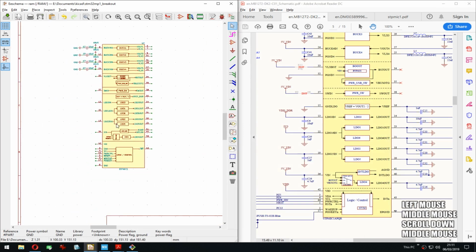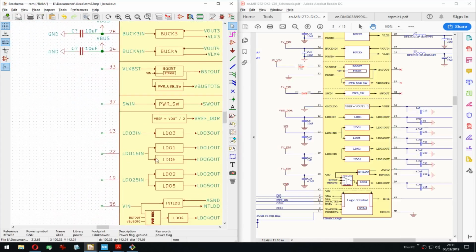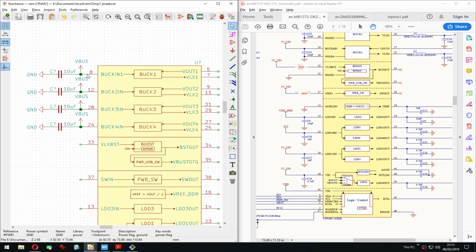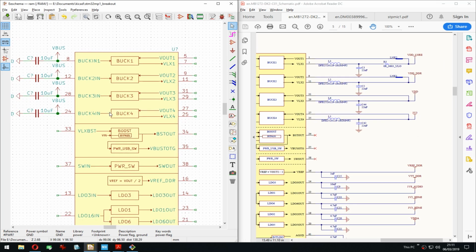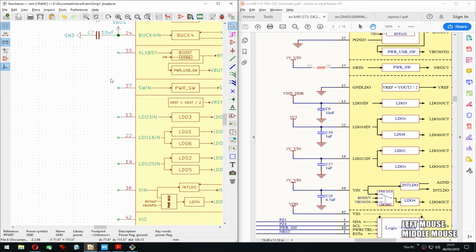But this, where was there? That means I'll have to do the battery logic myself. That's quite alright. I just need a battery to 5 volt buck, a separate buck, or maybe VBUS. Again, I need to read up on this. Can I actually go from 3.7 to all these other voltages, especially 3.3? That might be a bit too close. Never mind, later we can check.